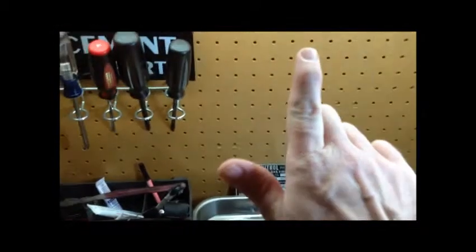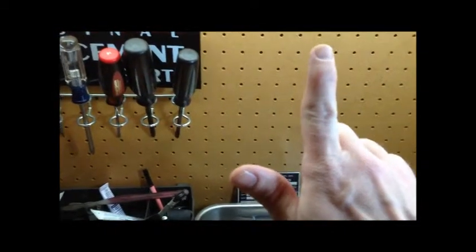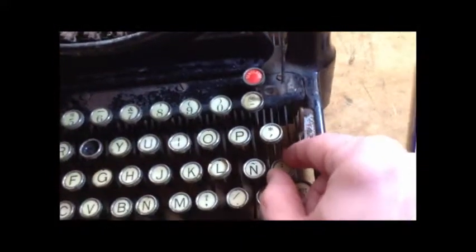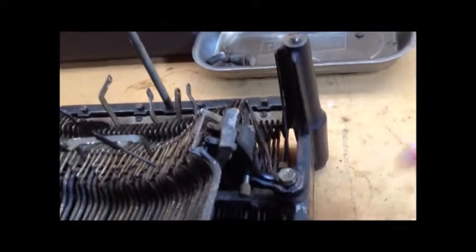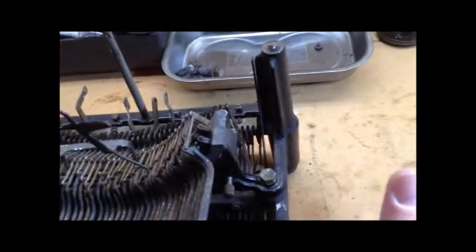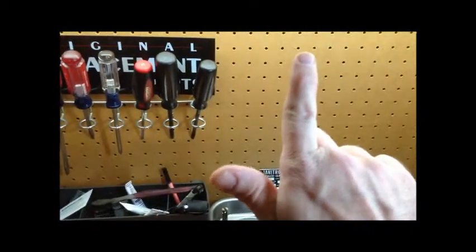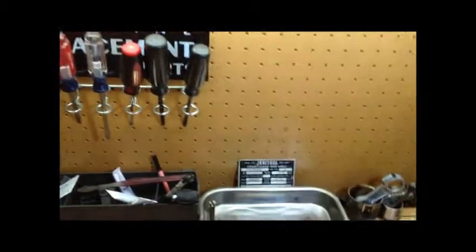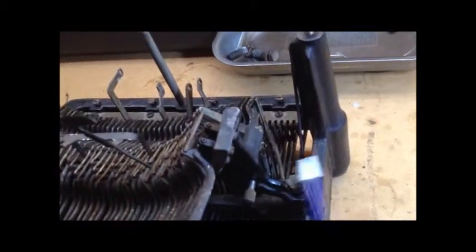If I look at my hand here and make a little bell crank — this is the part motivated by the primary key lever and this is that part sticking up — you can see that if I take the small amount of motion at the back of that primary key lever, because even though this key top goes way far up and down, there's very little motion actually occurring back here radially, but distance around the circumference of a circle prescribed — no. Well, if I use a bell crank like this, where I take that small amount of motion and transfer it to that lever, I get a large circumferential distance. So you'd think that would be what this is, and in fact the very first patents for the Visigraph are that way, but that's not how this machine's built at all.